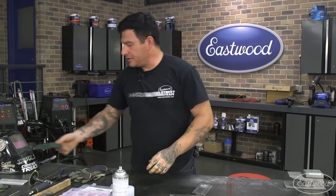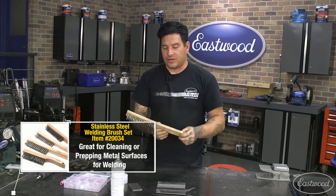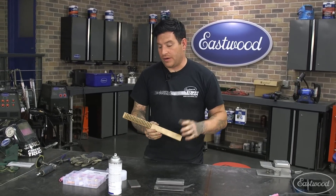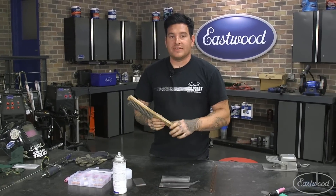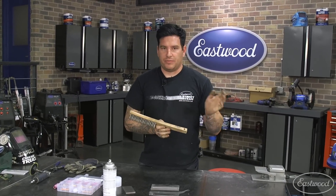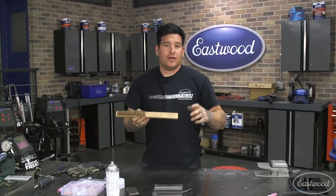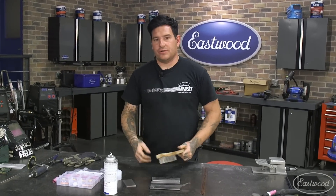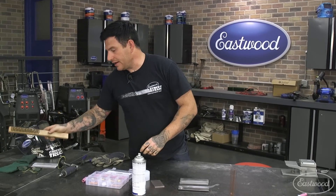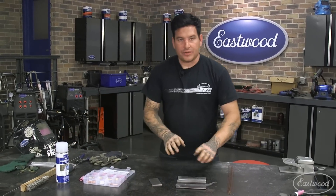You can use the scotch brite. Another thing you can do — I use it a lot on aluminum — is take a wire brush, preferably a stainless wire brush, and go over the part. It'll take off any corrosion or dirt that's gotten on the metal. A tip: get yourself two or three stainless brushes. You want a different stainless brush for every type of material you're using. I usually write on the side of it — steel, aluminum, stainless, whatever. The reason is when you use a brush on steel, it puts steel particles into the wire brush. Then when you go to use it on aluminum, you'll find it's grinding steel right into your piece. So that's the basics of prepping it.